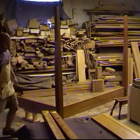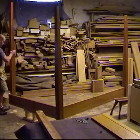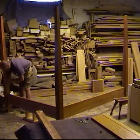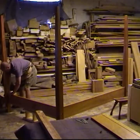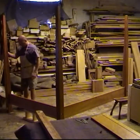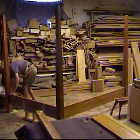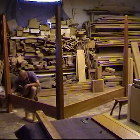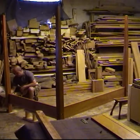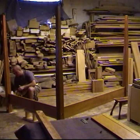Okay, now we'll go to the left foot, marked LF. Posts are slippery, so again, be careful, they are waxed. Again, set the post down, gently insert the dowels, give it a little tap. And a bolt. It doesn't go all the way, just give it a little tap until it catches. Tighten it by hand and then give it a couple of turns with the wrench.